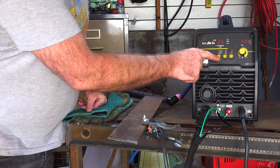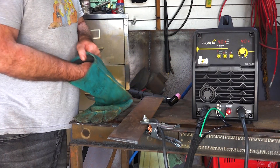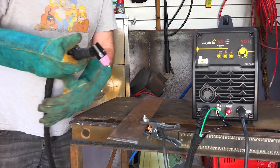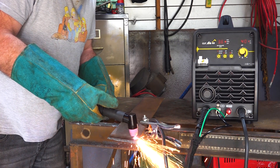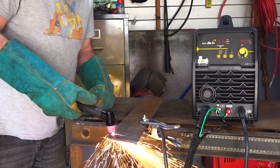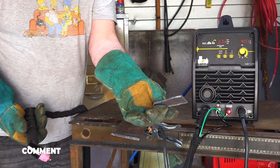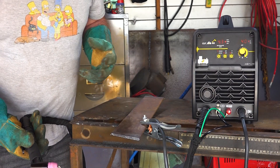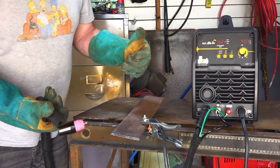Right, we'll do the same cut on 5mm but we'll go to the external compressor. We've gone from 2.5 bar to 4 bar — about 60 to 65 PSI — see if this cuts any quicker. 5mm is getting up there with thickness. Once again, piece of cake to cut through that using my big compressor. So all in all, this is much of a muchness — the compressor inside can handle what we're cutting so far. Let's try and go a little bit bigger again.